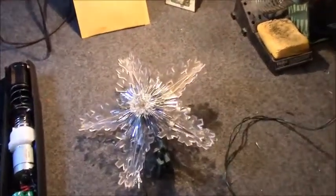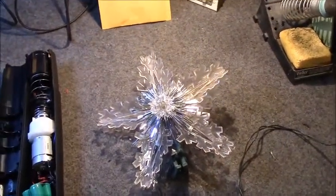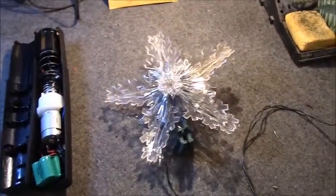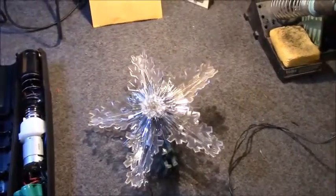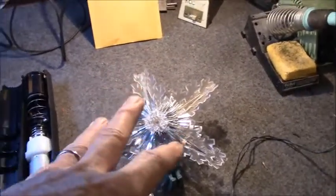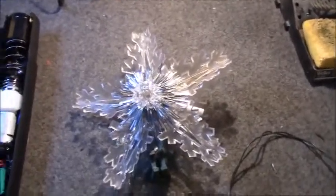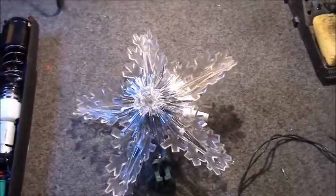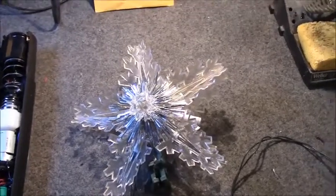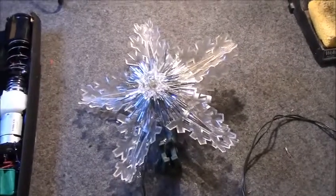Something that's been in my household since I've been married — I think this was the first tree topper we ever bought for our first Christmas tree in 1975. The bulbs have been dying in it. You can't put regular Christmas tree string bulbs in there because there are so few in here that you need special higher voltage bulbs, because the bulbs are in series. When you put light bulbs or resistors of the same values in series, the voltage is dropped equally across each one.